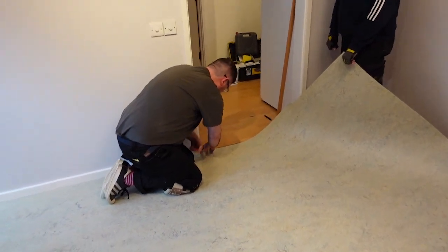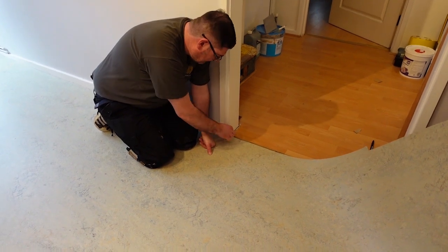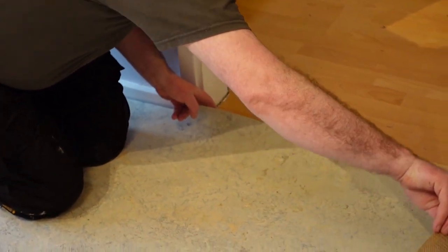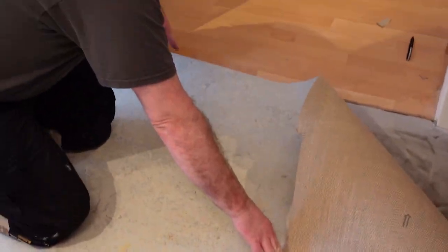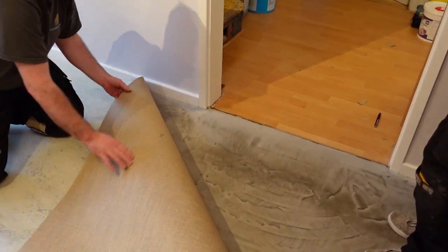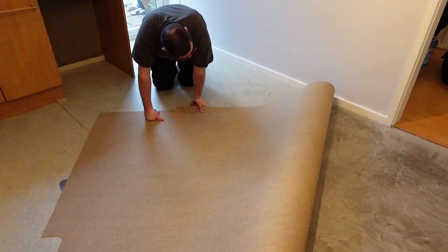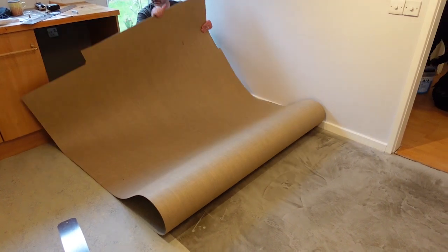So whenever you're taking a corner out like this, because if you was to pull that right back now, this corner here, where we've gone around the architrave, would split. It'd twist on itself and it'd probably snap off. So what I'd do here, I pull this off. Obviously, if you haven't got help with you, sorry Steve, look at me. I'd somehow try and hold that like that and pull this back. Push that back like that, take this section here, then I've got a release there, see? And then I can pull this back from here, or I'd undo this then when I come round this way, back we come, then up here, and there you go, you see, as you're pulling it out? And all we do, we just slide round. Slide it round, pull it round and up, about there.